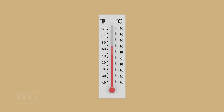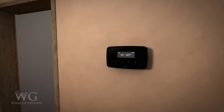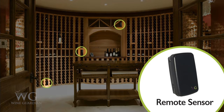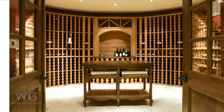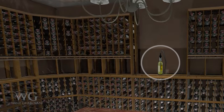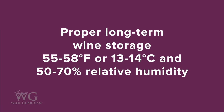To avoid degradation of your wine, it's important to control your cellar's environment based on the air temperature and not the liquid temperature of your wine. Generally, the thermostat should be placed at the midpoint of the room in an area that has sufficient airflow. You can place up to three remote sensors — exclusive to Wine Guardian — in the wine room at top, bottom, and midpoint to gain more accurate control of the space. Air temperature changes faster than wine temperature, so regulating air temperature will create a more stable environment. Bottle probes are unresponsive, force wine to change temperature, are unable to monitor humidity levels, and have the tendency to cause the cooling unit to run longer.